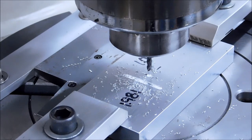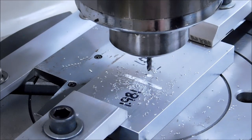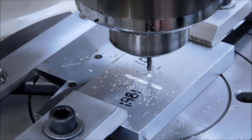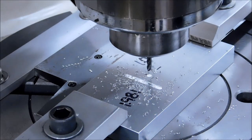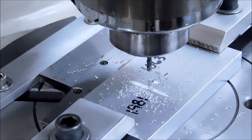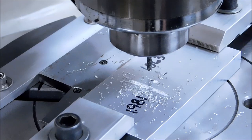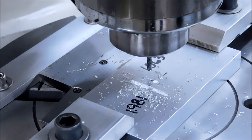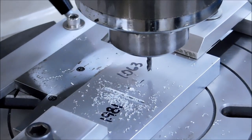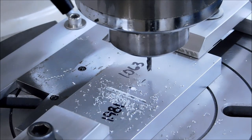And that is 333 on the dial. One side will be 27 and the other side will be 360 degrees minus 27. So that's where we are right now. Going to make a y-axis shift of the radius, 306. And an x-axis shift of the long leg of the larger triangle in the graphic, 601. Let's drop it down in there and check it out.